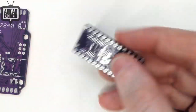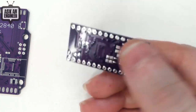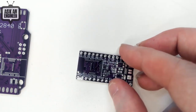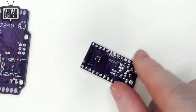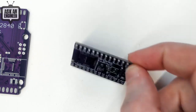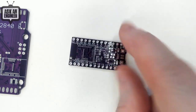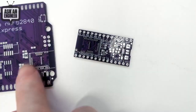I also had the Itsy-Bitsy version of the NRF52840 coming out. Double-sided, because there was just so much stuff I couldn't fit it all on one side. But it's got the module, QSPI flash on the back, two buttons, DotStar, power supply on the bottom, two micro-USB, and crystal. So we'll see how this goes — put this together, might work out.